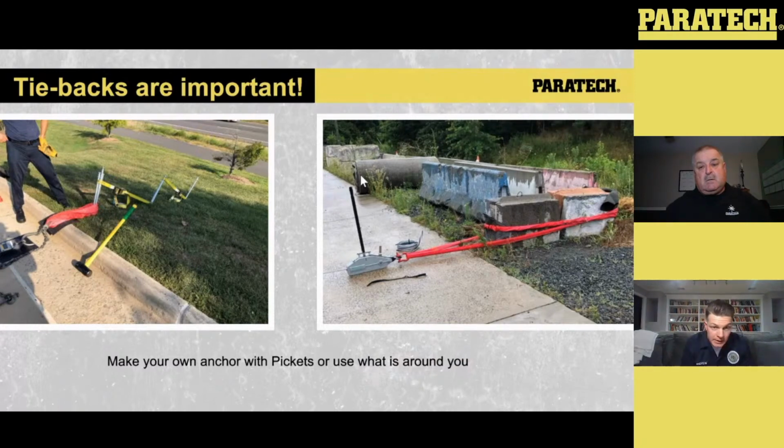and I won't go into degrees and everything, but a single picket is 700 pounds. A picket tied back into another picket is 1,400 pounds. When we do a 1-to-1-to-1 in those configurations, we're looking at about 1,800 pounds, and a 2-to-1 is rated at 2,000 pounds. So, think about what the application and the tieback is. Like I said earlier, the tieback's not taking a ton of force. So we're not dealing with a ton of load. We're just essentially preventing that from wanting to move one side or the other.